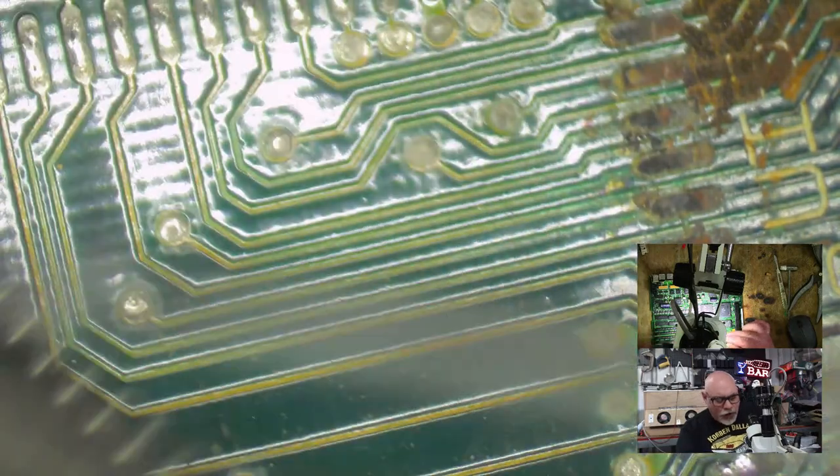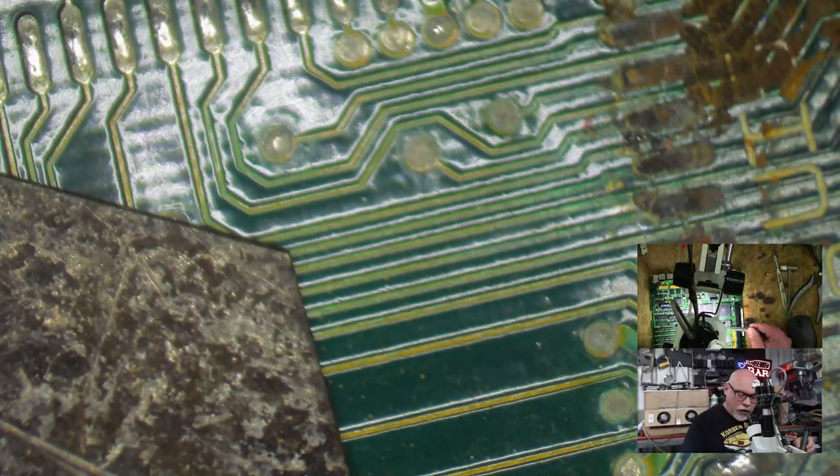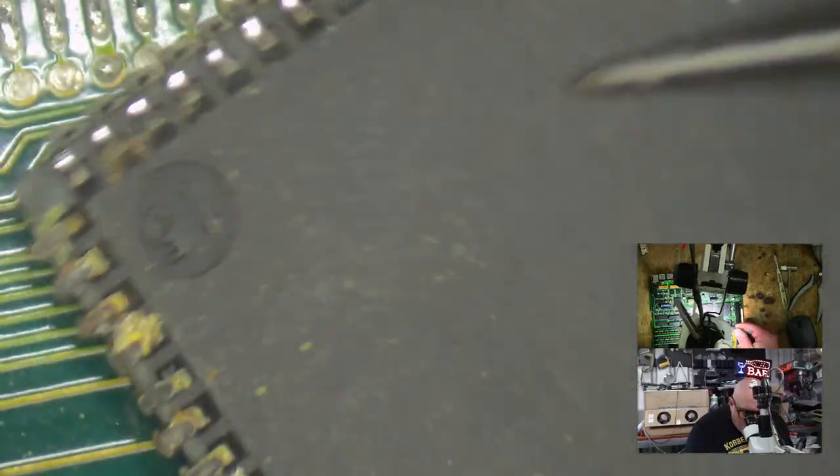It is one of the good things that some of these chips are still available. Thankfully, while there's a demand for them, a lot of companies are still trying to source them. Yes, they are faking them as well, and you have to be careful with that. One of the ways you can tell if you're getting a fake is that a lot of the time the printing on the top you can wipe off. But I generally buy mine from a reputable source, so if I do get a fake, I can always send it back.